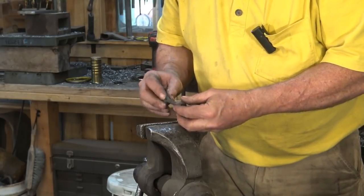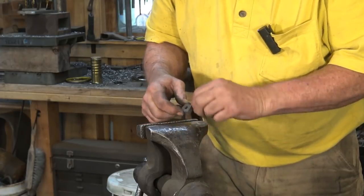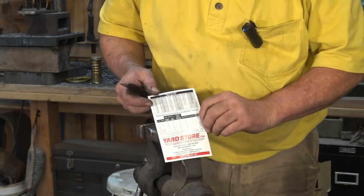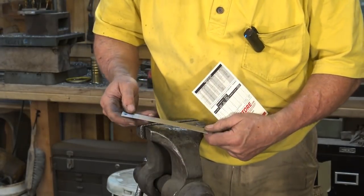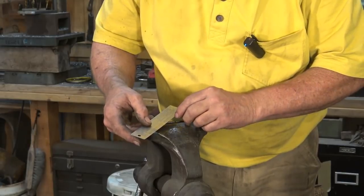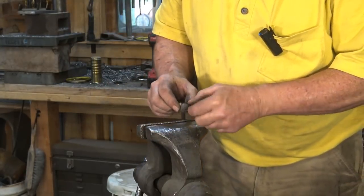But we should make sure the nut is also suitable to be threaded. There are reference charts available that will tell you exactly what drill size to use. If you buy a new tap that comes in its own package, frequently it'll say on the package. I rely on the charts — this one is just a little metal gauge. I keep it in a box with my full set of drill bits that has letter, number, and fractional sizes. I look up three-eighths coarse thread — that's three-eighths diameter, 16 threads per inch — and it tells me I want to drill a five-sixteenths hole. So I'm going to put a five-sixteenths drill bit through this hole to make sure I've got it right.